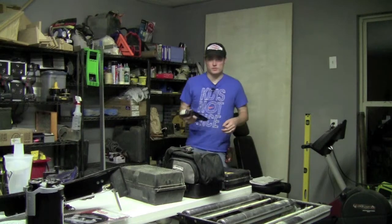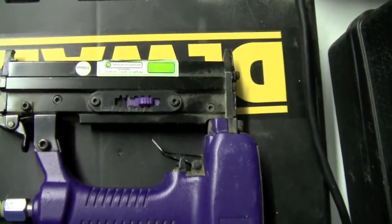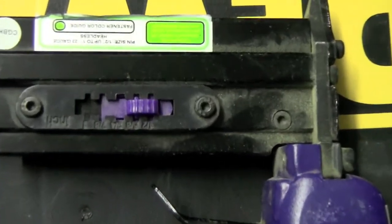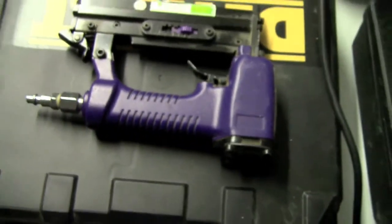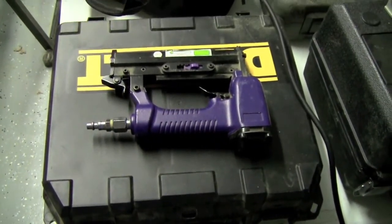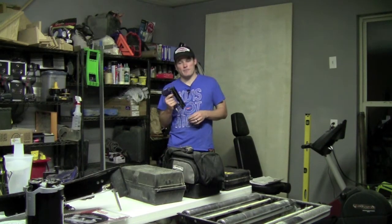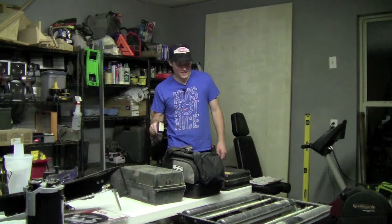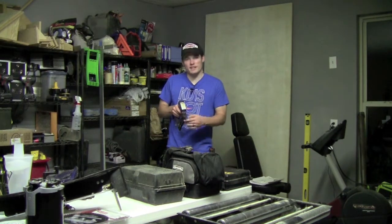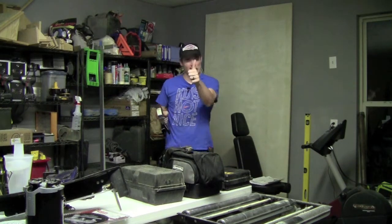Air nailers — I'll go over those real quick. What I have here is a little pin nailer that I got from Harbor Freight. It's a Central Pneumatic, so it's not a very high end unit. But everything that I've done with this, I've been very pleased. It's not broken once. I've had one jam because the pins are so small — even if you had a high end nailer, they're going to jam eventually. You just have to be careful because there's no guard. You can shoot these things all around your shop if you're not careful. Don't have your fingers close to where you're nailing because those nails are so small, they can pop right back out and into your thumb.